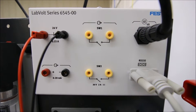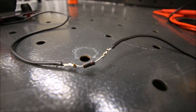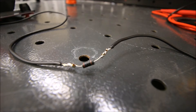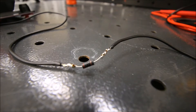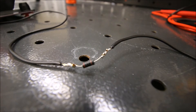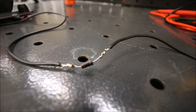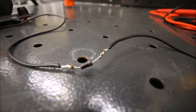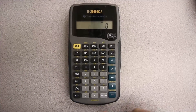Well it's as simple as putting in a 250 ohm resistor. So what I've done is I've just taken one of the jumper wires, I've cut it in half and I've soldered in our 250 ohm resistor. So what we're going to do is we're going to take this and connect it up to our 4 to 20 milliamp output. And if you use Ohm's law, which I'll show you on the screen in two seconds, with 4 to 20 milliamps and a 250 ohm resistor, you can get a 1 to 5 volt signal out.